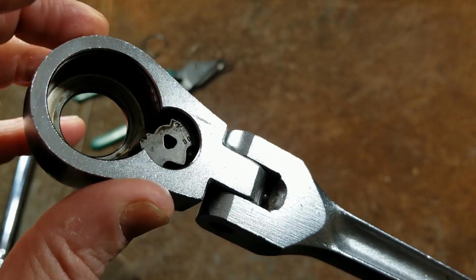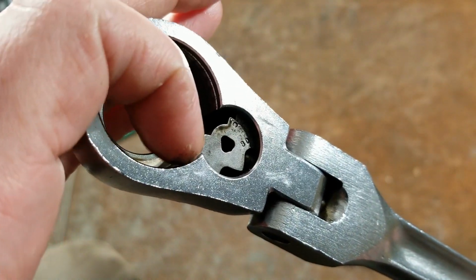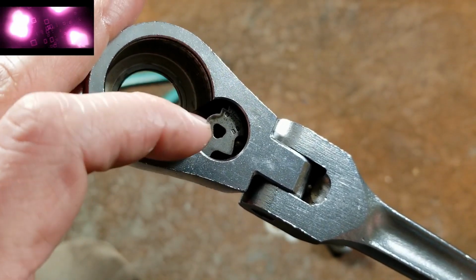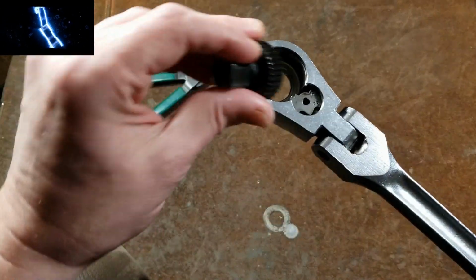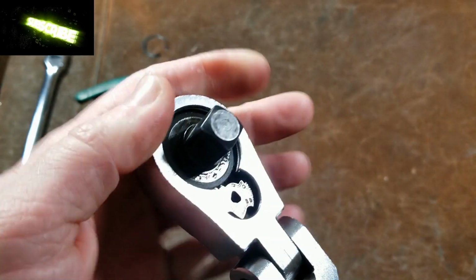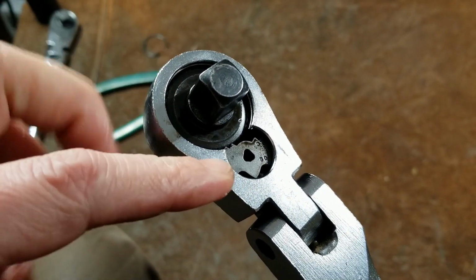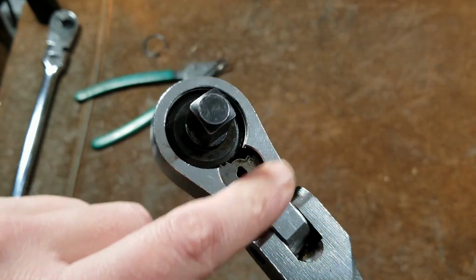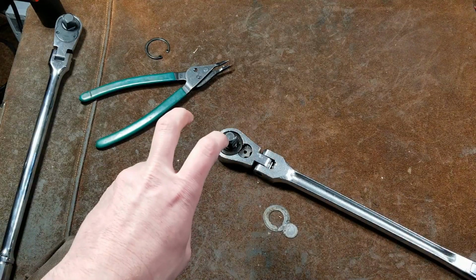And I've always liked this style just because it's really heavy duty. Instead of a pawl that's wedging between the anvil and the wall or the body of the ratchet, you have this where the forces are, let me put this back in here. Whoop. Here we are. So as we're ratcheting, when you're putting load onto it, it transfers to the teeth, and it's actually trying to push the pawl just flat against the other wall. And so this is a type of mechanism that would essentially never jam on you.